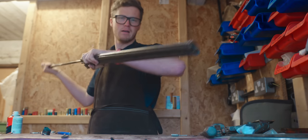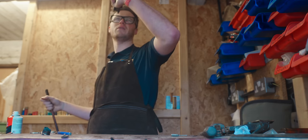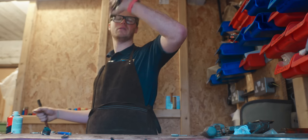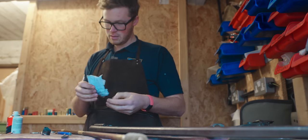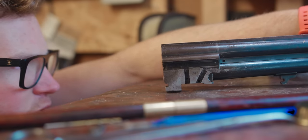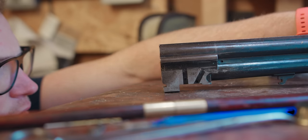Always feel like I'm firing muzzle loaders at this point. Look at that — the chambers are ever so slightly pitted, but the bore being chromed is absolutely tidy. A few little bits of lead fouling in there that we can still take out, but that's the beauty of a 30-second job with electric friends — everybody needs one. We've removed the rust. There is some light pitting in that top chamber, but not from a safety point of view — at least we took the rust out. We've done our job; this is as clean as it will ever be.